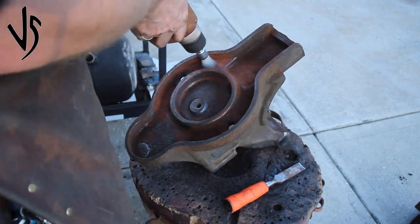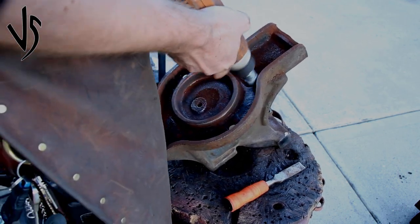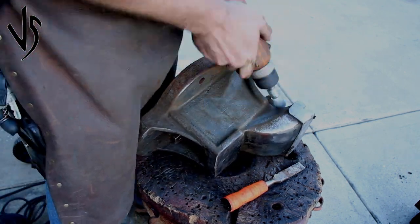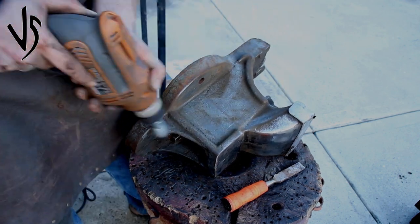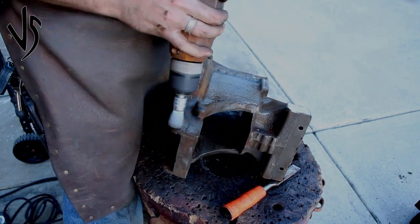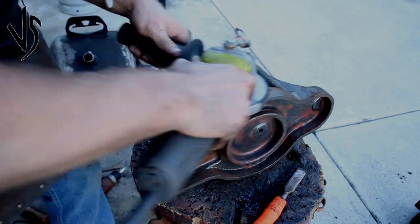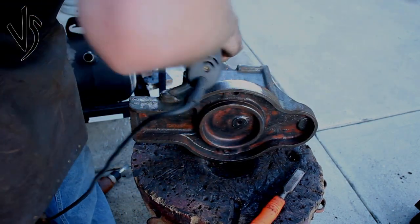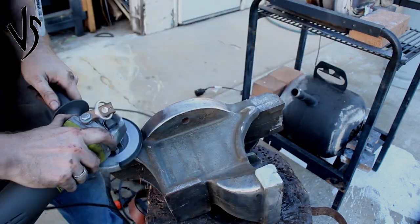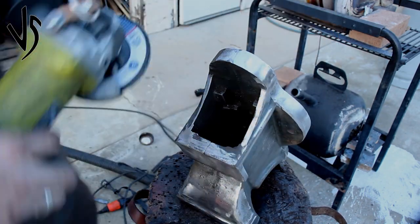Getting in all these grooves with the wire brush gets rid of that dirt, gunk, grease, and rust easily, bringing it back to a nice clean surface. Our goal here is not perfection — it is a cast piece so it won't ever look pristine — but we're looking for a piece that is free of all this crap. While going in with the angle grinder and flap disc, I'm actually making a lot of these casting parts look much cleaner and smoother than they were designed to be. I decided since I'm at it, might as well make it look nice on the parts that are easily accessible and most viewed.